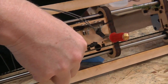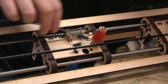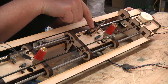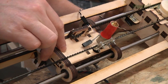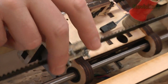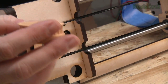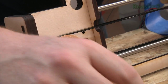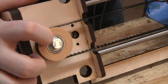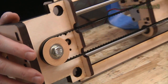So we had to make sure the belt was tight. We had some trouble clamping it, but I ended up using some PETG plastic with little teeth made into it so it fits right under the belt. The problem with that is you can't really adjust it, so this end of the loop has its own little clamp so it can be adjusted. Then the belt wasn't long enough because this printer is too big, so we actually had to make a coupling and make it so it wouldn't hit these parts — and it just barely won't. The coupling also has the little teeth so it clamps right under the belt. The last problem was the pulley — we used the original but it bound up and caused friction. So I made a new pulley which is free-flowing and I made it so a skate bearing snaps into it for nice rotation, and a metric bolt holds it into place.